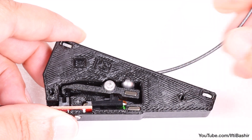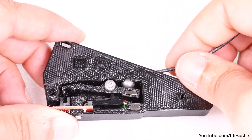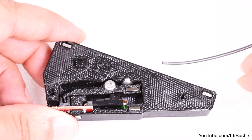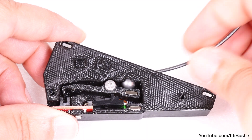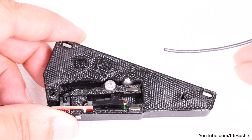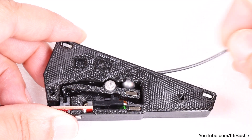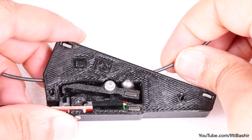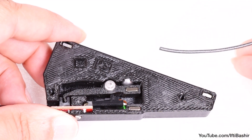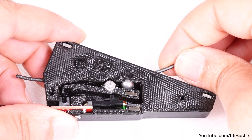Here's how it works: when a piece of filament is fed into the sensor from one side, it pushes the ball down and out of the way, which in turn pushes the lever up and out of the sensor, activating it and signaling that filament is inserted. When filament is removed, the magnets repel and push the ball back up into the gap while the lever is pushed back down, creating a break in the sensor and informing it that no filament is present.